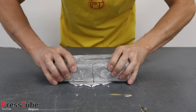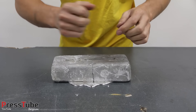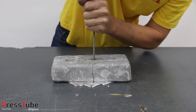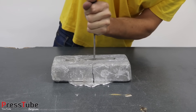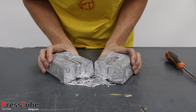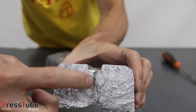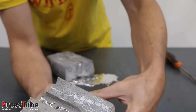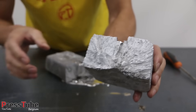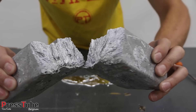Okay, here we go. It's still quite firm, so I'm going to take a screwdriver, put it in that crack, and try to pull it apart. It's moving! This is quite an amazing result. Here you can see one of the holes I drilled — there is still some gallium on the ingot. Here is another hole, and another. This is the hole I drilled, so it's not all the way through. The gallium has eaten away the entire ingot so that it could be pulled apart.